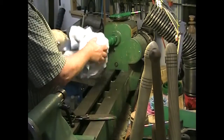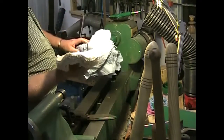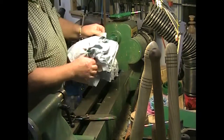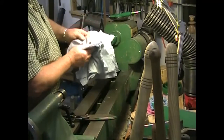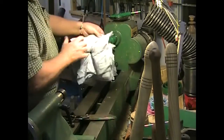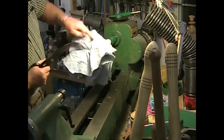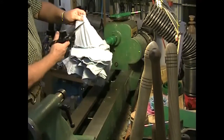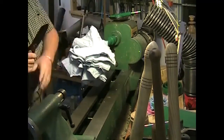You can see how it's fluffed out now that they're individual sheets, and it would be extremely difficult to reach that bolt when you're buffing anything. It's quite soft and very flexible. I find I use the flannelette for all three materials — I don't have buffing mops with the thicker material. Now, just to help balance it a little bit, I'm going to cut the corners off. Sharp scissors are a big help here — this means there's going to be less material to cut off with the skew gouge.